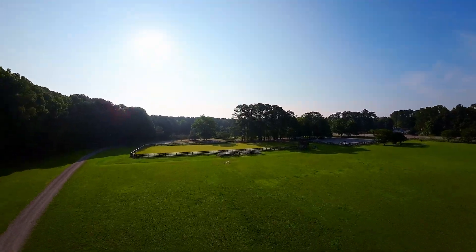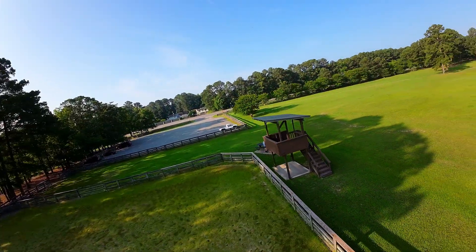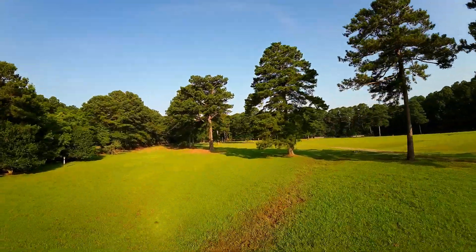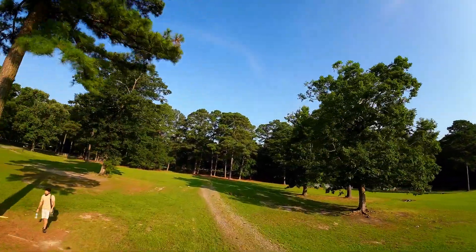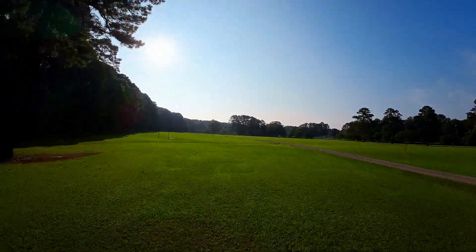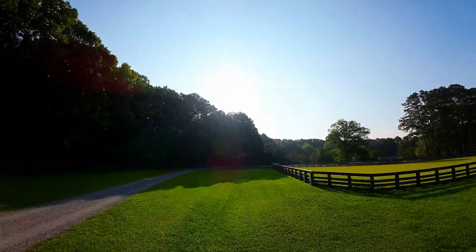This is crazy — this is default tune. The rates I've slowed down slightly, but all this is default PIDs, the filters are default, the tune is default on 4.4 Betaflight. This is amazing. We're 2 minutes and 30 seconds on the 1300 milliamp battery. This is absolutely amazing. It is smooth, it has really got a lot of pep to it, and I'm just cruising here at quarter throttle, a third at most, and it is just moving right along.